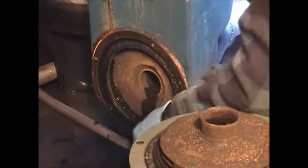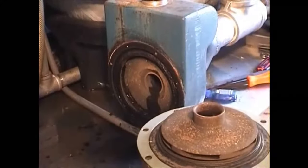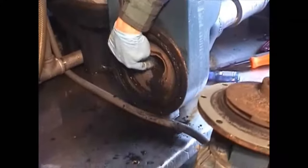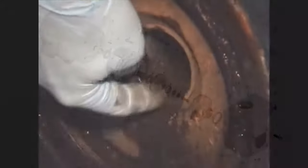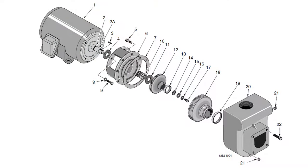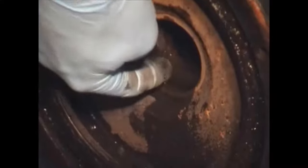Now is a good time, after everything is completely clean, to inspect something inside the volute. There's a diffuser inside the volute, and the diffuser has a bronze ring pressed into it — that's your wear ring, and the impeller fits inside it, inside the diffuser inside the volute. In the exploded diagram, that's part number 13 highlighted in bronze, inside number 18 which is your diffuser. If that wear ring is sticking out, tap it back in place with a soft-face hammer; if it's sticking out, your pump may make noise when you bolt everything back together.